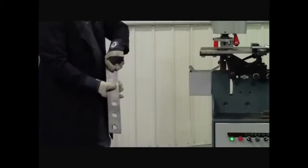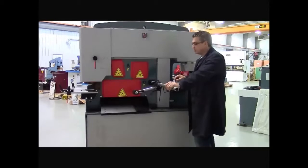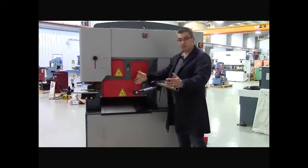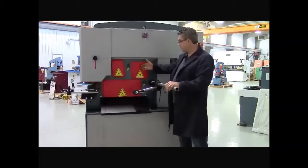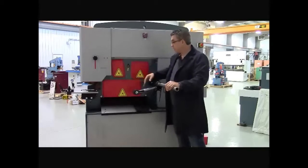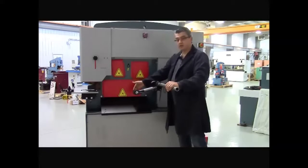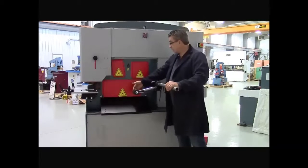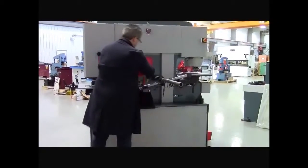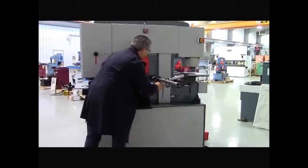Neat job on your punching. Another really nice feature on this machine is the electric backstop. What it does is if you had a repetitive run of either angle, flat, or round or square bar, you can set this up so that when you push your piece through you don't have to hit the foot pedal every time — it'll just trip every time you hit it. I'm going to set it up here on the flat bar portion.